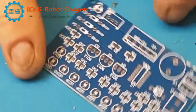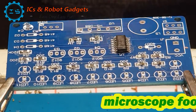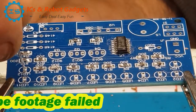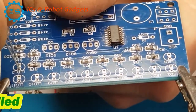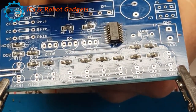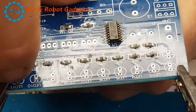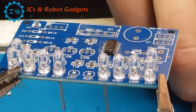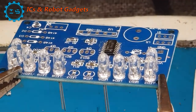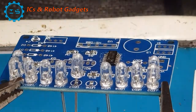Okay, so here's the circuit board. I'll turn it around so it's the right way up for you. Now we'll carry on, I think we'll put the LEDs in. So we're back on the nice camera phone, so decent audio. Remembering the short leg goes with the flat line on the silk screen, or the flat line on the end of the arrow for the diode, as the picture goes. At least these two are in the right place, or these four rather. That's yellow. And the remaining yellow.